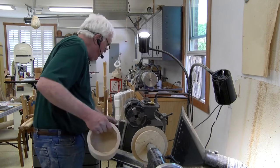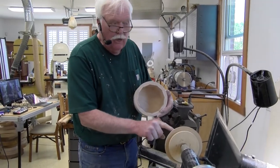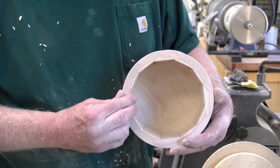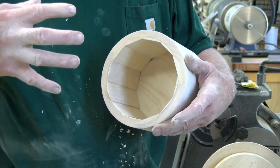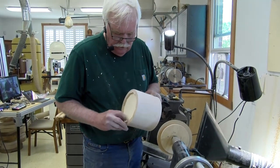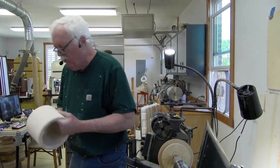We've got a sanded box. This little inside edge — I was telling you I didn't go all the way down because I didn't want to mar that angular support. I can either break that off or I'm going to come in later and cut a rabbet around there so the top will fit down in it. About the bottom, I'm just going to clean up with some sandpaper and knock those edges off. Let's take it across the room and do a finish on it.